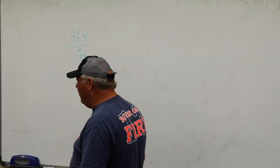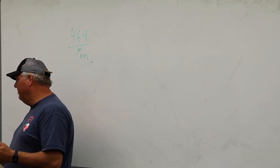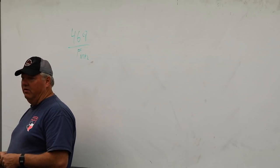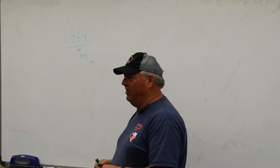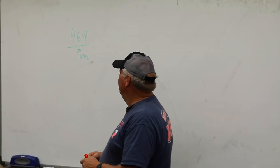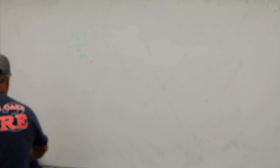So if we were going to build a dipole for, let's pick a common band, 80 meters, what would we do? This is interactive. I'm not going to talk to you guys. Somebody help me out. 468 divided by the frequency.